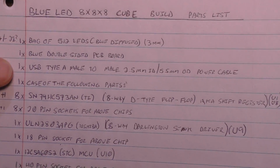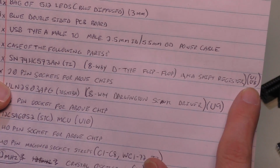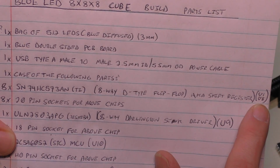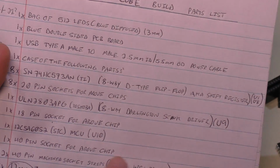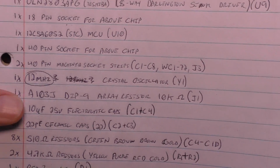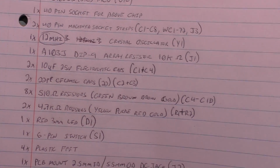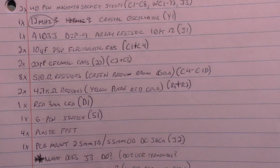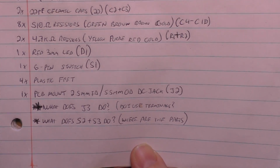Here's what I basically did. This is the parts list, and as I took these out, I wrote down where they belong. For example, the eight shift registers are U1 through U8. The Darlington sink driver is U9. The MCU is U10, and so on. This is all going to be down in the description. Hopefully this will make it easier for somebody else to do this build. There are Instructables on these things. I may even put this into a PDF file or a Google Doc, who knows.